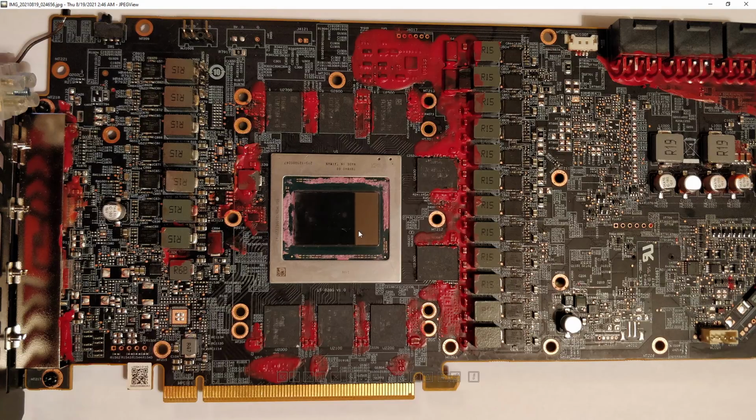And yeah, so after removing the GPU core, the VRM fires up, except for the power stage that I failed to replace. So, card is super dead. But maybe we'll get some really cool X-ray shots out of it if I figure out who to. Well, actually, I already know who I want to send this to. It's just a matter of seeing if they'll be willing to take it.